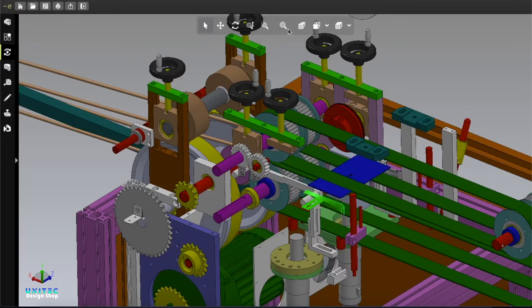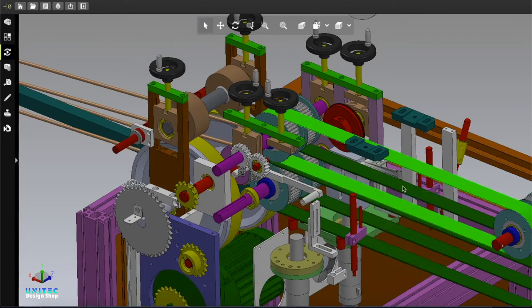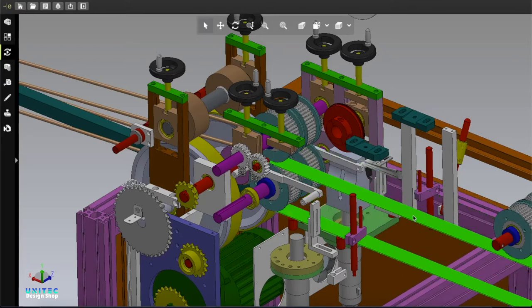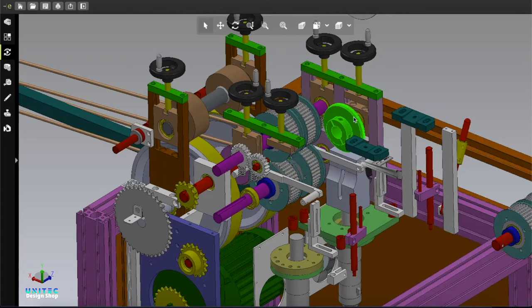Here is the folder. When the tape comes it gets into this area, and when it goes like this it just gets folded in a very rounded way - it covers this side and gets sealed. There are many belts actually - not one belt, two belts, even four belts total. On the opposite side it is the same: one roller and one ultrasonic horn, with the ultrasonic frame connected by screws.